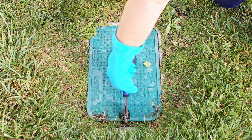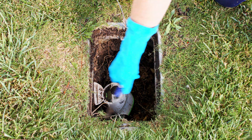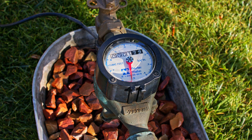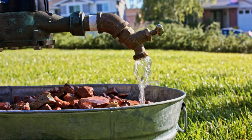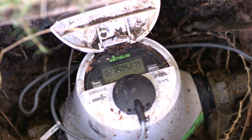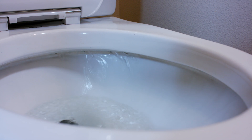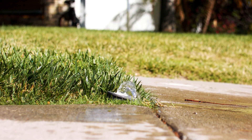Open the plastic meter cover, lift the lid, and wipe off the meter if needed. Keep an eye out for critters and creepy crawlies. Most meters are equipped with a flow sensor, so if the meter is moving while the water is shut off, then a leak may be occurring in or around your home. New meters are electronic — note the last three digits on the far right of the display. They should remain stationary when water is not passing through the meter. The most common water leaks include running toilets, faulty irrigation valves, or main service line breaks.